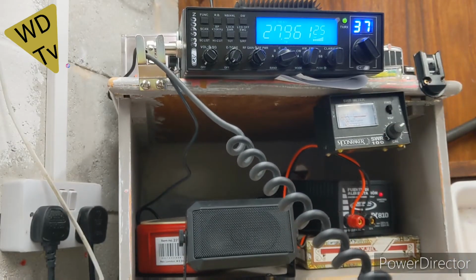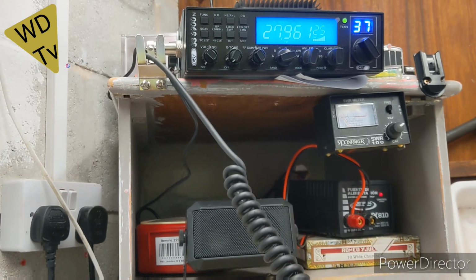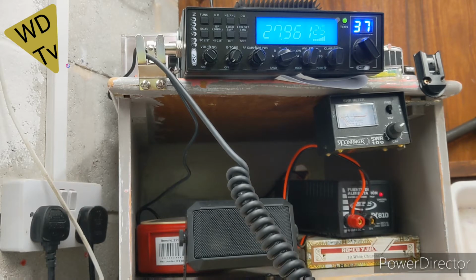Yeah, that's really why I did it that way, just to be sure, because that would have been my next move. I'd run it through the tuner, because that goes straight to the ground spike. If it cured it, we'd know that Bruce's was the issue and not the radio. But I didn't know how to do that because it's fine straight to the antenna. That's all that's in line between the rig and the aerial. Like I say, I just found a choke and put it on the top, just below the PL259, to stop the noise coming back down it. That's all that's in line now.